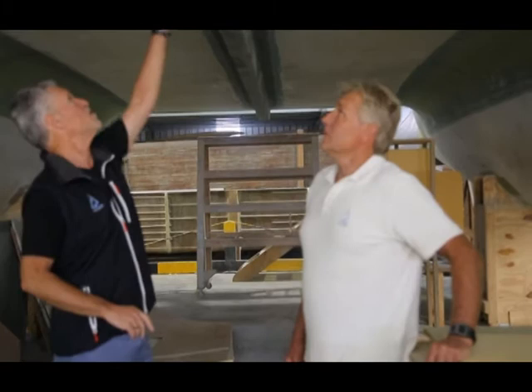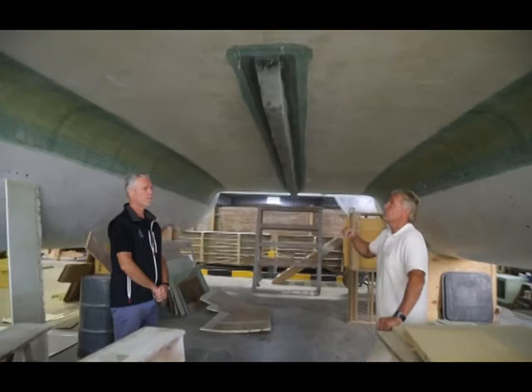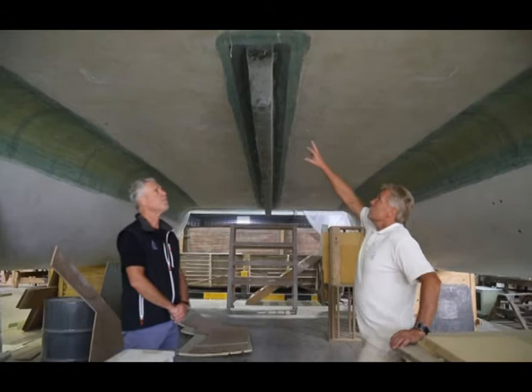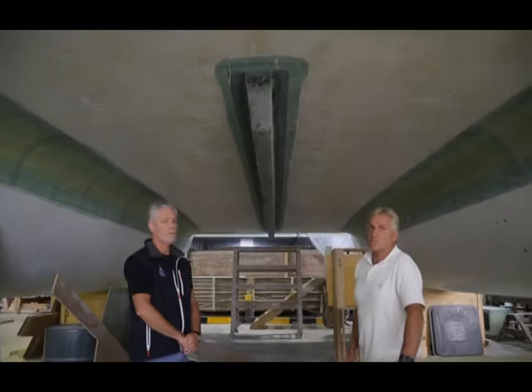You can see these black areas here. This is a stiffening streak running right through the full length of the boat. Underneath here you've probably got about 14 layers of carbon. That's vacuum-foamed and it's gone under vacuum pressure. The carbon you see there is also part of the whole structure, so that's really keeping the boat stiff in its full length.